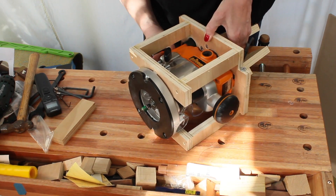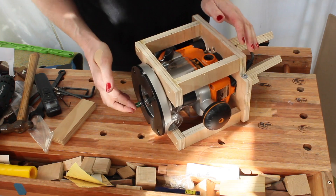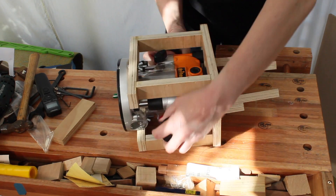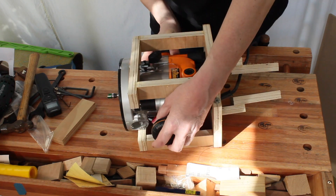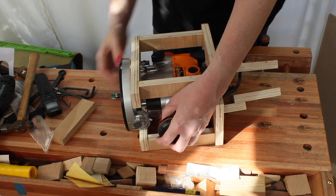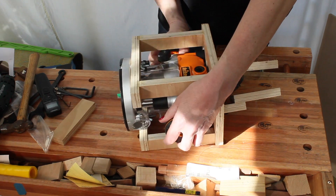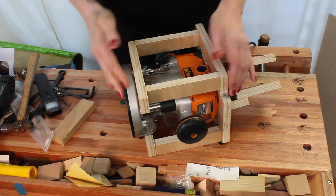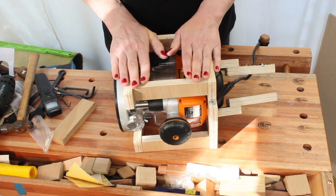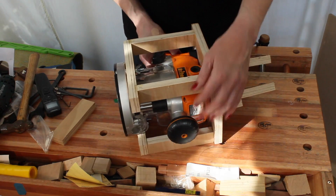This is really just for adjustment of the depth when I'm making multiple passes. In practice for the sort of things I'm going to be doing I won't actually need that much adjustment. So really I've just got, by eyeball, about 30mm of adjustment I think. Any more and I'm at the full extent — it's locked so I can't actually go that far. In practice I've only got about 20mm of adjustment but I think I'm okay with that. This has been a sort of compromise in many ways but I should be alright. That's just to give me fine adjustment while I'm actually doing the work. The actual height of the router will be mostly adjusted by whatever's attached to the side of the frame, so this is really just fine adjustment.